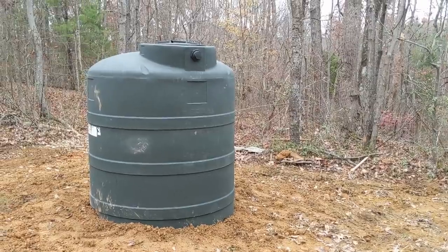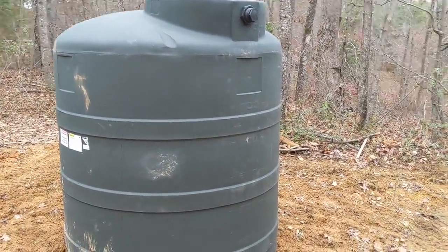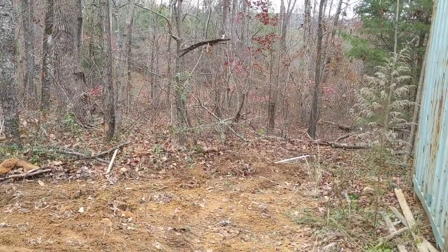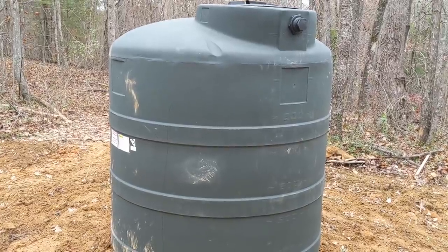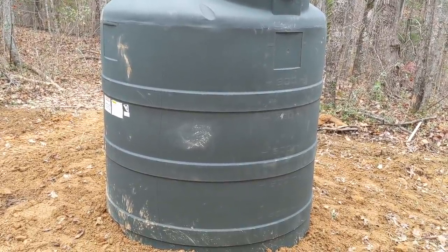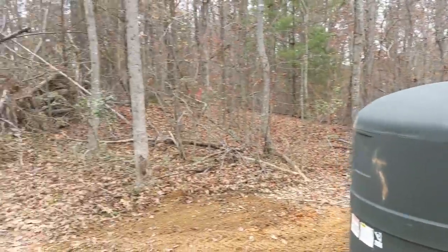These are the first time I've used Canadian Solar panels. Just finishing up a solar water pumping project — this is always my favorite. It pumps up to an elevated tank and then overflows. The customers are going to use the overflow for a variety of homesteading needs, capturing water in totes. This will turn over once a day, supplying the whole homestead. The tank has a two-inch trunk line running down to the house — good for house needs, firefighting, and spigots along the way. The tank is up on a ridge, the highest point on their property.